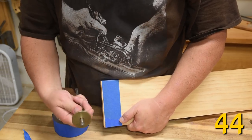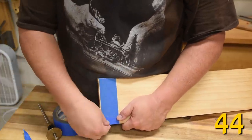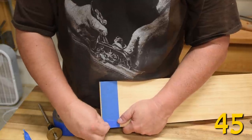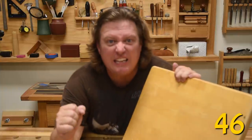If you use blue tape in conjunction with your marking wheel, you don't have to score as deep a line to make your mark, and you don't have to take as deep a shaving when you use your woodworking eraser to get rid of the line. Ikea is the largest hardwood buyer in the world, so all that crap that ends up out on the curb in five years is great cheap raw material.